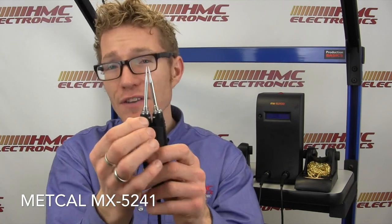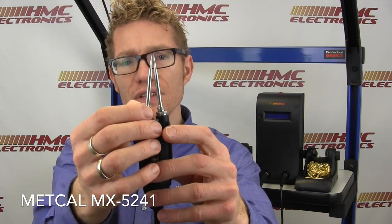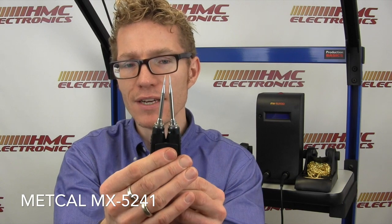The adjustments — if you can see here — you've got two collars on the handpiece. One of these collars, when adjusted, adjusts the vertical height of the tip. The other collar, when adjusted, controls the orientation of the tip in a small circular motion. This is so that you can very easily line up the two tips. When I was plugging in the PTTC701, the very small tips, it took me but a moment to get the tips absolutely perfectly aligned using this method.